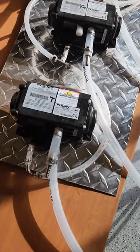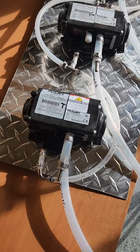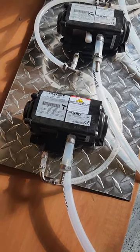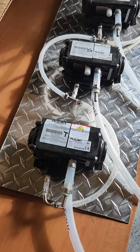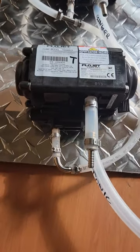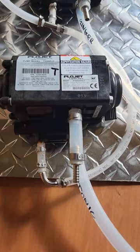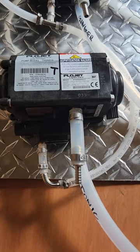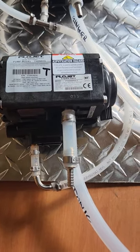The next section basically pumps it directly into the bottom of the machine through a chilling coil and up to the valve. The valve itself is the first photo you sent me — I'll send you a photo on that. You'll see on the photo four adjustments in a line with white adjustment knobs sticking up that you screw in and out with a flat head screwdriver.